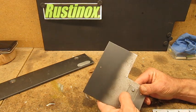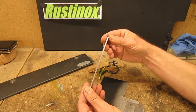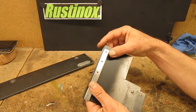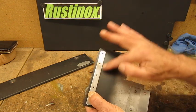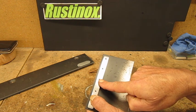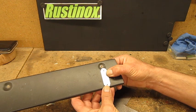Now imagine I want to reinforce this little piece of sheet metal. I made this, I think it's 3 or 4 millimeters, I don't know, to reinforce. We're gonna put some rivets and hold it together. And I did put some black paint on it so you can better see the difference. Here we're gonna make conical rivets, and this will be the mushrooms, the dome rivets.